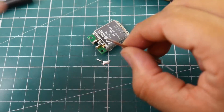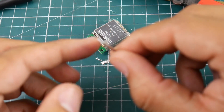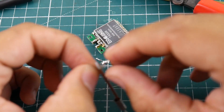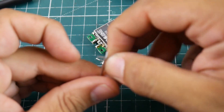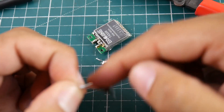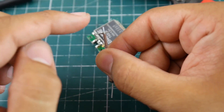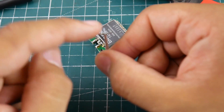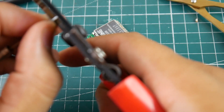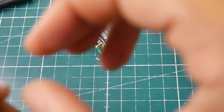As you can tell, you have these little hairs on the outside. What you want to do is not remove those — you want to start moving them away, and then it'll reveal the little plastic thing right in the middle. I like to get it on both sides and be careful with these hairs — you don't want them to touch the inner part. Kind of shape it like a little angel. Sometimes if you're just pinching that plastic piece in the middle, you can actually pull the antenna core through — you don't want that. Just bite a small bit with your cutter — this takes a lot of practice.